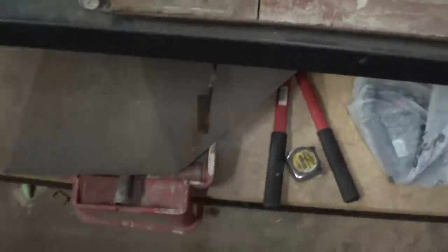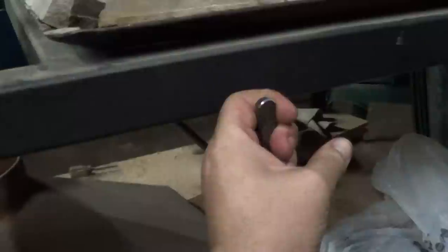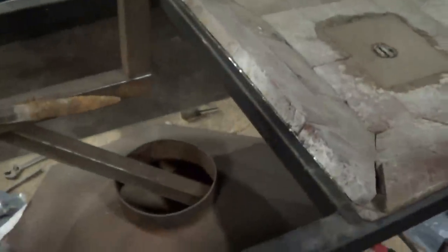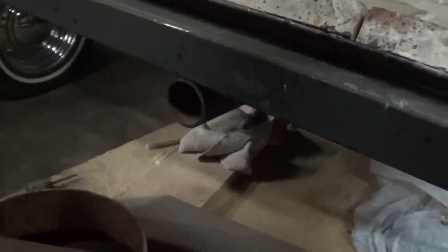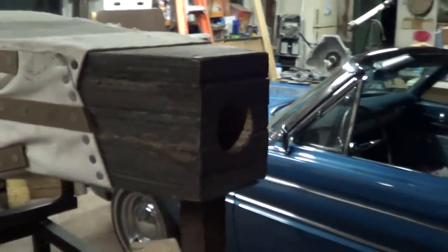Anyways, we got the tweer put back on, and we have our little lever. That'll give us full air, and then all the way to closed, or mostly closed, and anywhere in between. Next step, we're going to hook up the pipe that slides on the end of the tuyere down here, or the tweer, and it'll slide on, clamp in place, and then come up, and then we'll build an adapter for that nozzle.